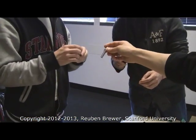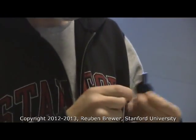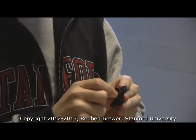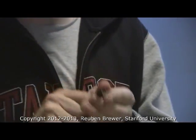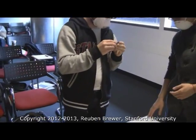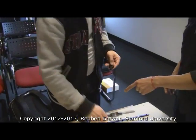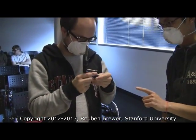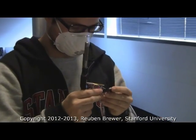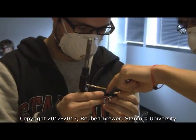Well done. Pay more attention to making the drill at a right angle to the plate — it doesn't need to be perfect, but it'll help. Are you having them self-tap the wood? Yeah. Just one of the chamfered holes. Hold the plate like this and start out slow until you get the feel for it. Go until you're just about at the end, then reverse.